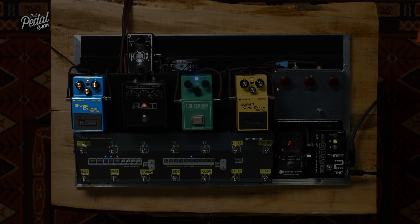But with the tone control in the Klon, it's like, is it after 400 Hertz, 500 Hertz? We can either start adding treble or we can take treble away. Exactly. Add, remove. Never knew that. So that's a proper EQ circuit where we're either adding top end or taking it away.